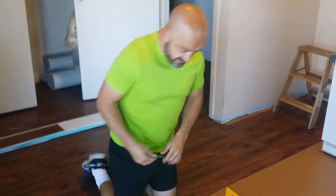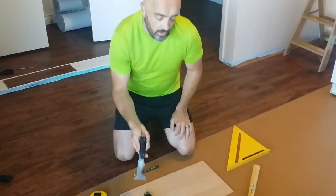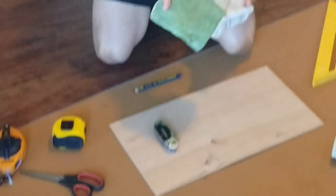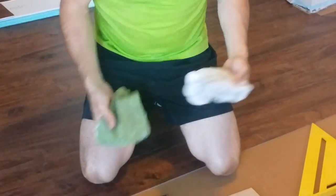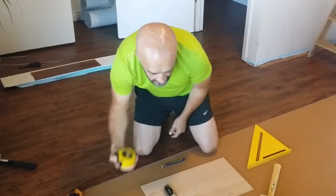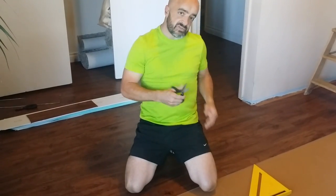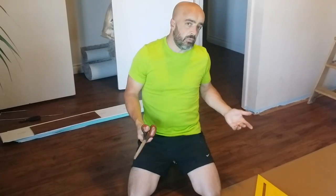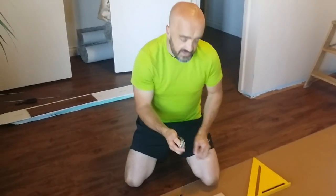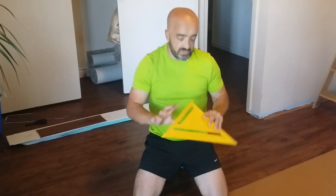Here's all the things you're going to need if you're going to do it the way I've found is best. A firm paint scraper — if you're doing concrete, you're going to find little bumps of paint and you'll scrape those flat. You're going to need a wet rag; I've found using ammonia in water works well because it takes the oils off the paint or whatever substrate you're sticking to. A dry rag, a tape measure, a pair of scissors — because you can cut as precisely as you want, but going around a wall with vinyl you can use scissors and save yourself a lot of precision work since you'll be covering it with molding anyway. And obviously a box knife and a pencil.